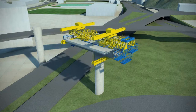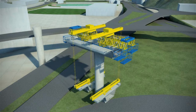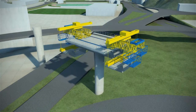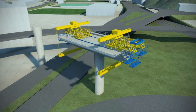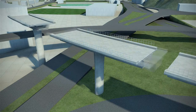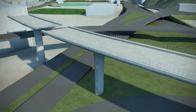As a result, the beam and winch system has a far smaller area of influence compared to a more typical crane erection method. The beam and winch can also pick up to 11 precast segments from the same location. Coupled with the reduced setup time and ability to deliver modules outside of peak traffic conditions, this all adds up to a construction methodology that reduces the public impact in the form of fewer and less frequent temporary traffic management arrangements.